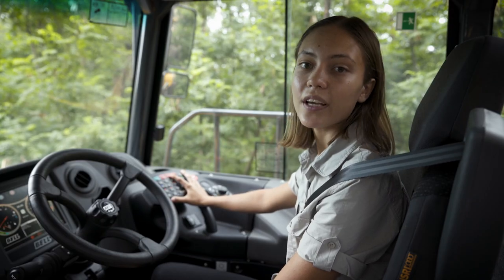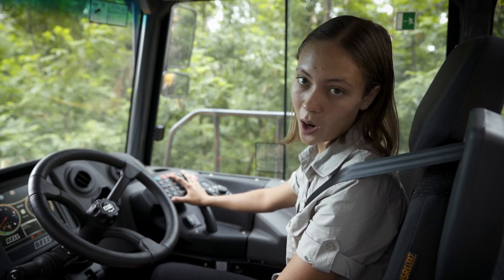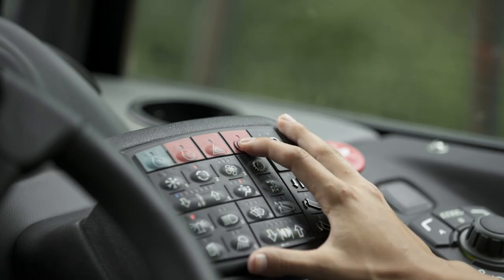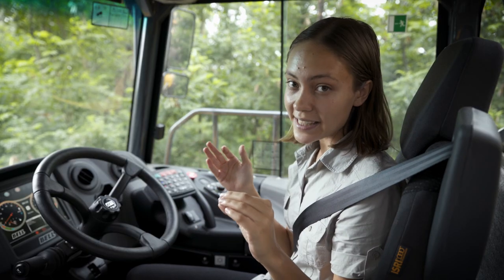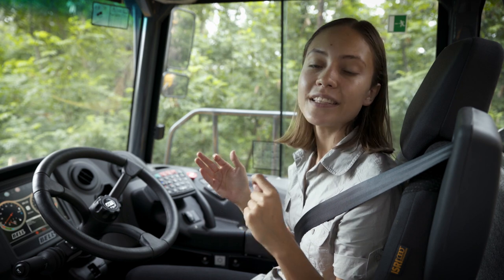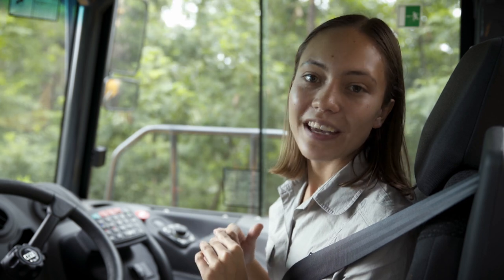This hazard button works whether the ignition power is on or off. If the ignition is off, the CDU lights and warning alarm will be off. The park brake button is marked with a P. A short press will apply or release the park brake manually, but the truck is programmed to keep the automatic park brake applied whilst in neutral as a safety measure to prevent any uncontrolled movement.